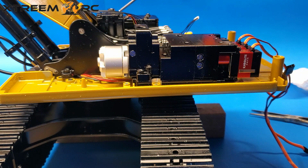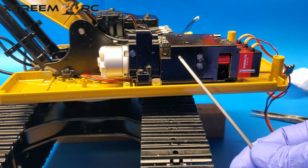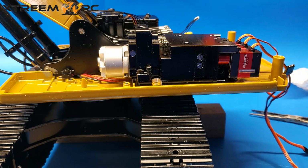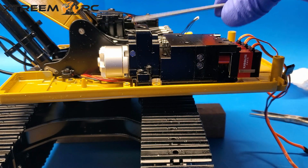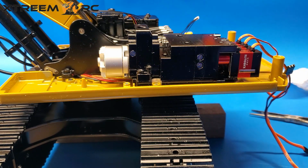It actually has all the fluid from the tank flows underneath into this bottom plate, and then it comes up through this block here, which goes through the valves and then goes through to the hoses. But the pump is what decides what moves and what doesn't, because without the pump, these things don't really matter. It'll just let all the fluid out. So let's get into it.